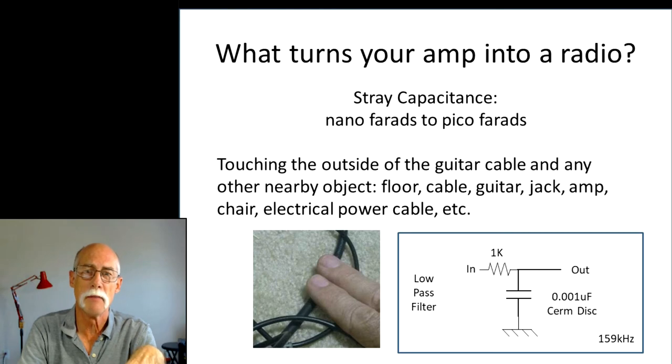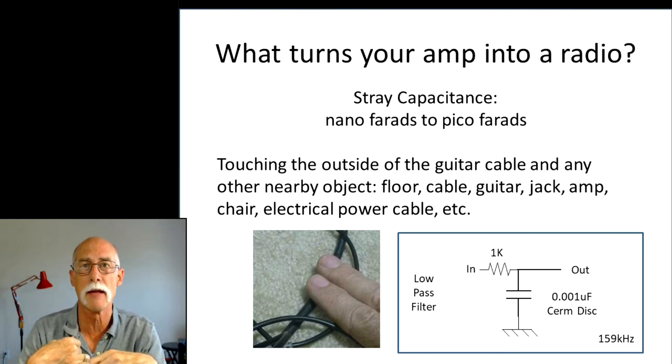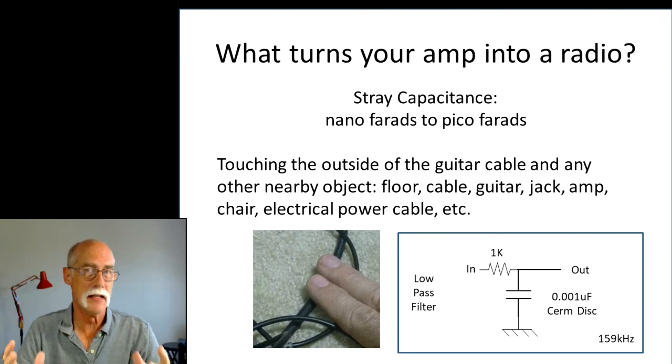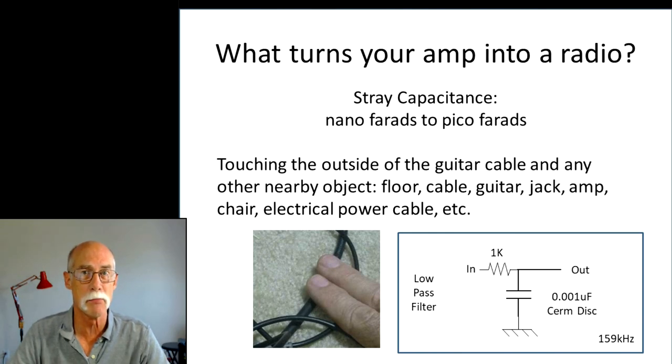The circuit for a low-pass filter or RF filter — shown in the bottom right of your screen — uses a 1K resistor, which is not going to drop the signal hardly at all. It will clean up a lot of buzz in itself — it's like putting in a ferrite bead. Then the .001 microfarad capacitor, signal in, signal out, arranged like this, starts filtering from 160 kilohertz down, which typically will stop the buzz in your guitar amp. In the next video, I've got an excellent demonstration of exactly that, using this circuit to stop the buzz you're hearing. Hope you found this useful — thank you for watching.